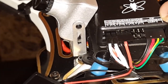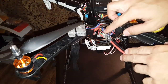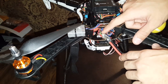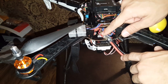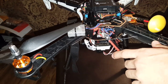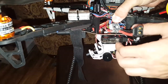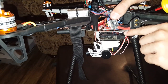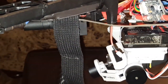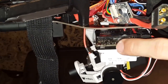Here we have the power module — it comes with the APM Mini Pro — and we can see the pins right here. It's maybe 6 or 7 pin, so it comes with the cable already, running from here to the power module port. I'm running a Radio Link AT9 as a transmitter, so channel 1 and then a 3 servo lead to channels 2, 3, and 4. I only have 5 connected, skipping 6, and then I have my pitch and roll for my gimbal on there.